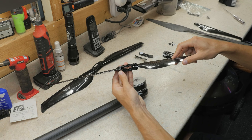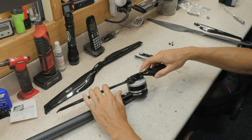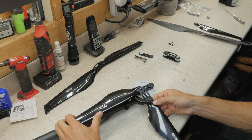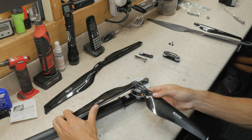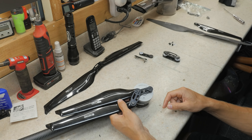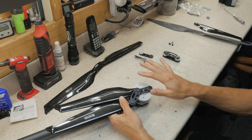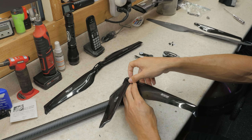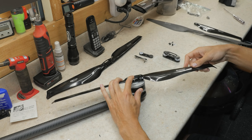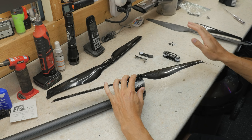I'll show you why. I've taken out the screws in the middle, so if I put the propeller on the motor, what's going to happen in the air is if this screw shears, there's a drag force on the propeller which is going to cause the propeller and the top adapter — because there's friction in there — to stay attached to the top plate and end up swinging around, essentially folding mid-air while spinning. This folding action will cause a severely imbalanced propeller, likely rip your drone arm apart, and your flight controller won't be able to handle the vibration — your drone is going to crash. Thankfully, their adapters have those screws in the middle, so if the blade screws fail, the plates stay together and won't fold back. The propeller blade stays extended, and in my case I could hear a slight hissing in the air due to wobble, but I was able to safely land every time.